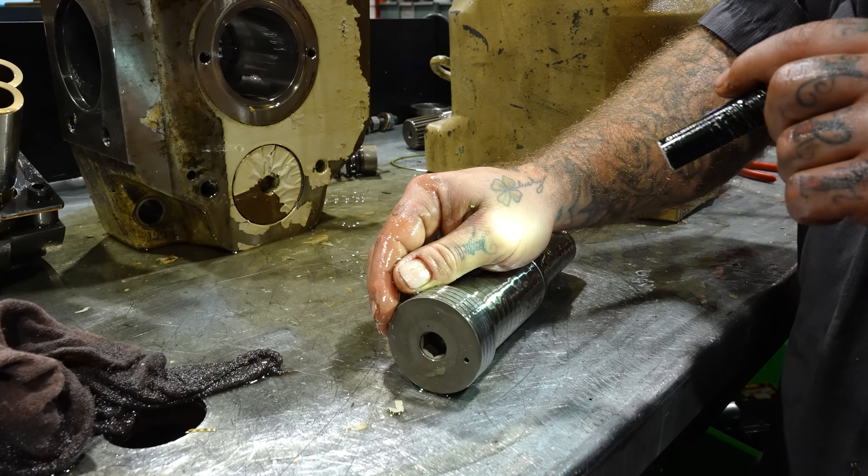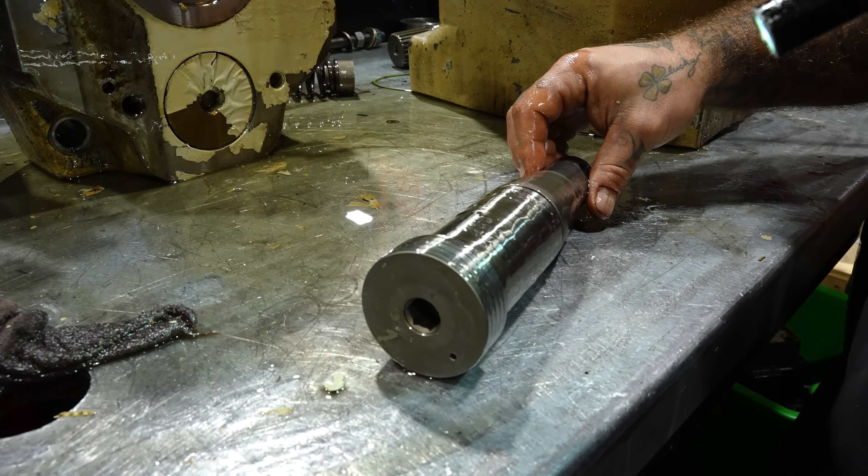Pretty rough there too. That's a servo piston — the controller would control this. The controller is modulating, so this servo piston would be modulating with it. It would be moving back and forth quite rapidly. It would also probably be on comp or turned off for a long period of time in a factory, which could also be kind of hard on it because there's less surface area connecting that to the housing.